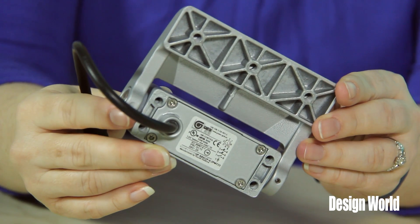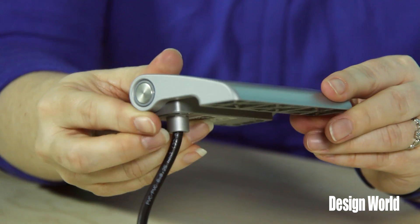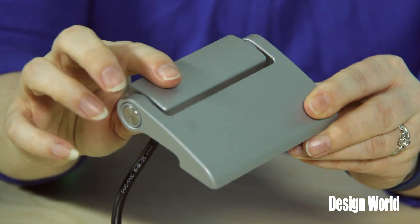More specifically, there are three separate contacts built into this thing — two normally closed and one normally open. They change state when someone opens the door. In that regard, the hinge is designed to function as part of a safety system.